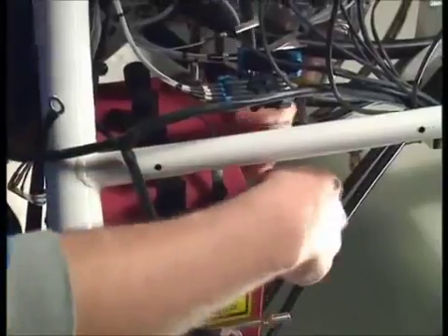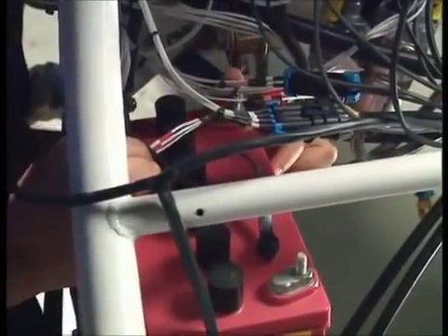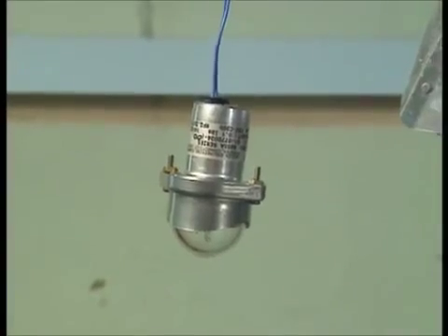Last thing is the battery. It's a standard 12-volt wet battery, but it's an aviation battery rather than a car battery, obviously. Just got two positive connections down this side, so that's on like that. And then this side are the earth connections. It's a bit worrying, this. Nothing happened, no lights on. That's good.